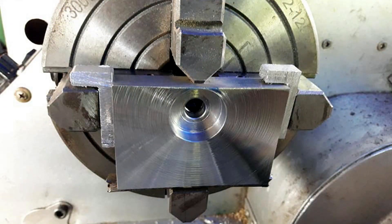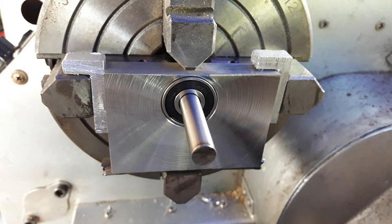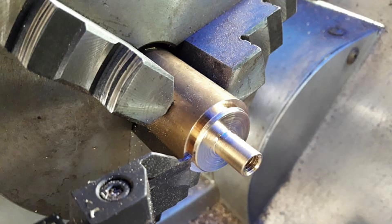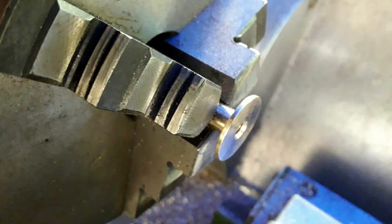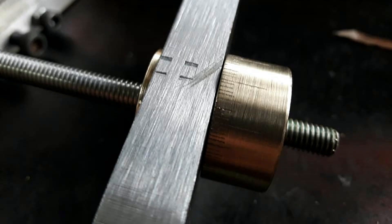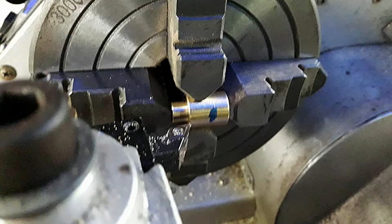We had to make some bearing housings for the compound slide. It has no thrust bearings at all — I've just used a skateboard wheel bearing and machined up a little brass bush that fits through the center of that on one side as a thrust washer. The other side has another brass bush pushed up against it. Everything screws onto a 6mm all-thread — I bought stainless steel all-thread, which seems to be better quality than the mild steel ones floating around.